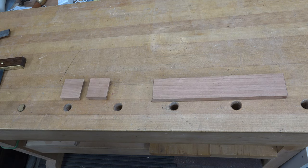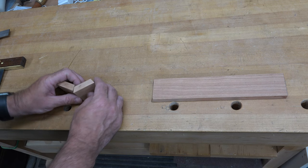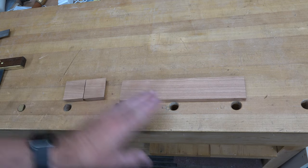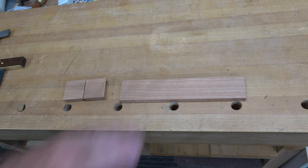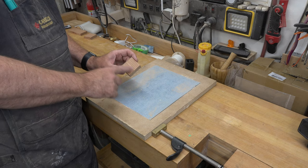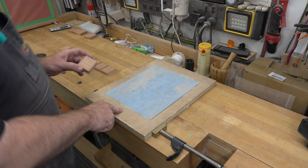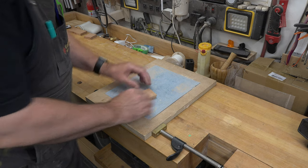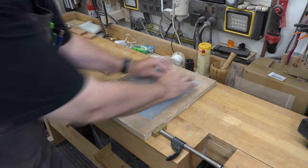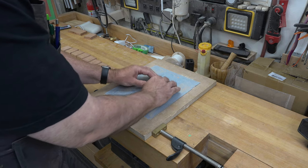Since we're making a nine-sided box, continue labeling and cutting all the way across the stock until we have all nine pieces. With all nine pieces cut, sand the interior surface using sandpaper on a piece of three-quarter-inch MDF — only sand the inside for now. Important: don't mix up the order of your pieces; pay attention to the labels to keep them in the right order.